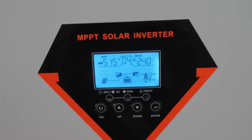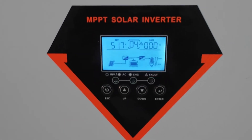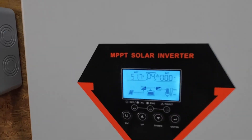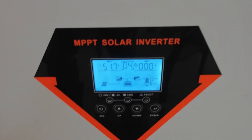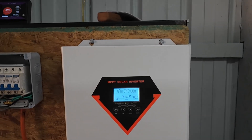Got 500 watts coming in off the PV right now. I'm not going to sit here and wait for this. I'll put this on the tripod and keep it running. There's no load on the inverter right now and it's charging — a little over 500 watts coming in. So let's see if that fault goes away after it charges the battery some. There's no way there can be an over-temp because we're only charging at 500 watts right now.